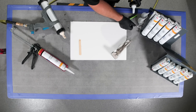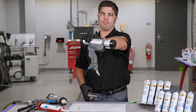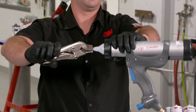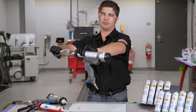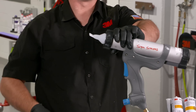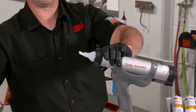Once we have that cut off, we're going to take a Duckbill Vise Grips and we want the angle at the top. What we're going to do is clamp this about an inch back. We just want to manipulate that plastic just a little bit — we're trying to get it flattened out and create kind of a nose effect. Another key thing is you want to leave it a little bit in an upright position, as this is going to help when you're laying out the bead.